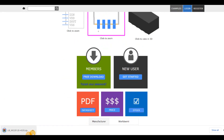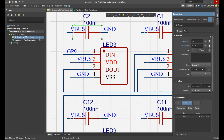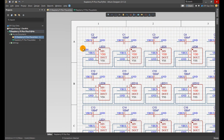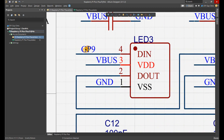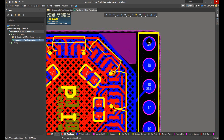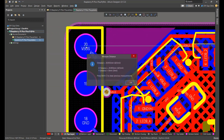I connected the LED pixels in series and placed the decoupling capacitors, using a small 0603 package for the capacitors to keep a small size for the host board. The first LED will receive the pixel's RGB parameters through GP9 of the Pico. I then created the PCB design and measured the exact spacing value between both header connectors to match the Pico edge pins, setting them as bottom layer components.